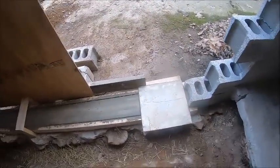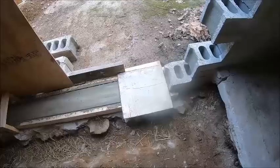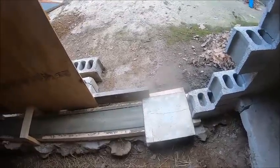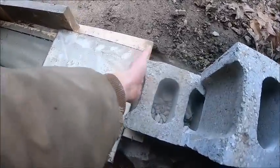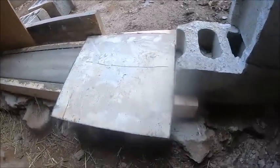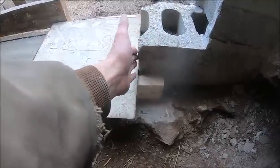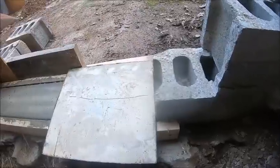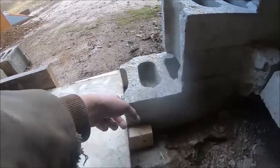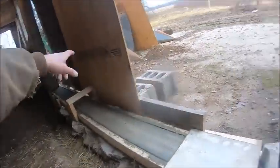Okay, so I just laid a steel plate across there. I'm brainstorming ideas as to what to put across there so that I don't accidentally hurt the concrete. Here, obviously, your scallop is still out of the brick, and over here when they had this doorway, they filled that full of concrete. I think what I'm going to do is see if I can get a board here and fill this up with mortar. Gonna have to do something anyway, because the round edge block is gonna overhang, and you don't want it just sitting over air. So if I can get this full of mortar so that it's flat, A, it'll match that side, B, it'll support the block.